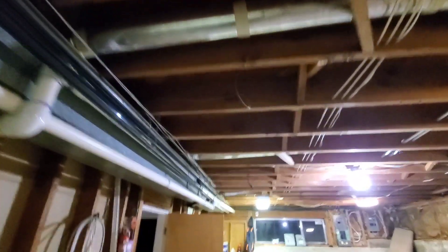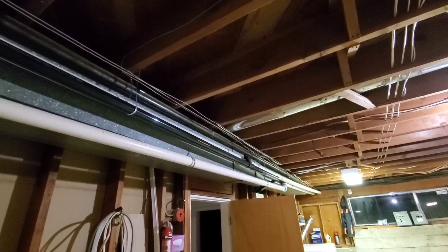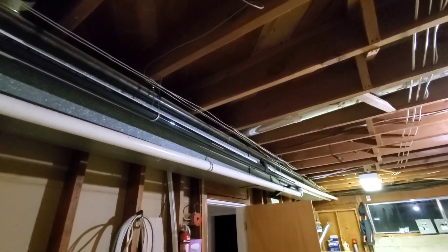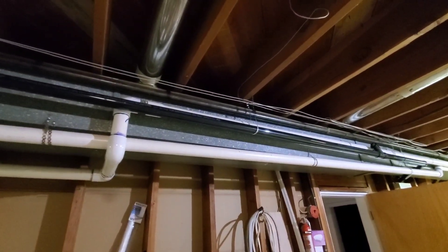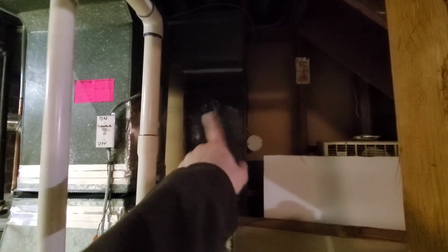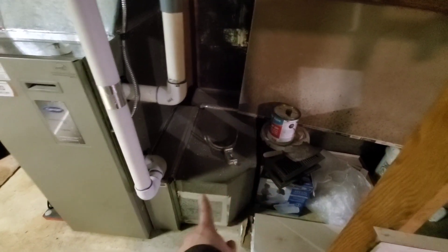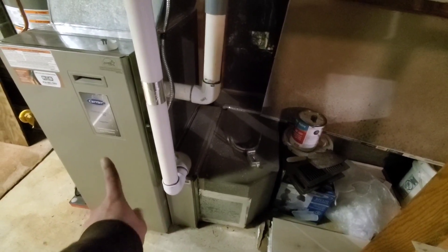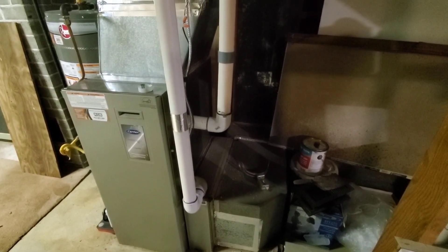We have a takeoff here and a takeoff there. The way this system works is, as it's pumping fresh warm air into the room, it's also pulling air from the return side back to the furnace to be warmed back up. This stud space, which is covered, is a return duct — it comes down, our filter is here, goes down into the furnace, our blower is here, and then it blows warm air back up. Now we'll look at a supply duct and a return duct.